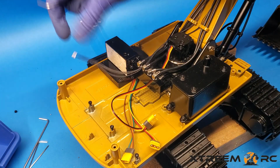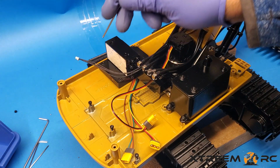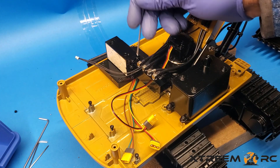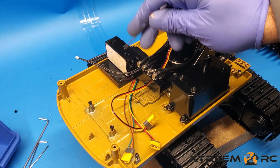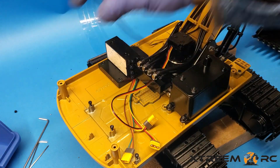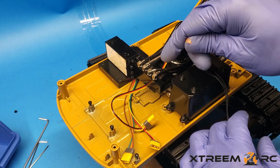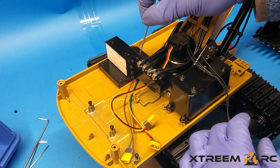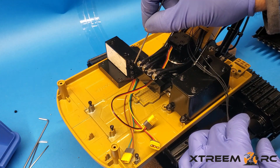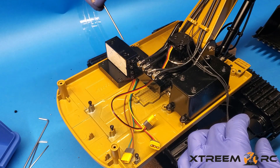And this is what connects the valve block, and then from this side is the pump. And then all the fluids go into this assembly here through the hoses into the different cylinders. So we want to check this. A good area to look at if you're getting any leaks, again, is from all these different connections here, or around this perimeter, okay, where all these screws are, or from underneath here, okay, because there's two holes under here that come into this. So we're going to remove it.